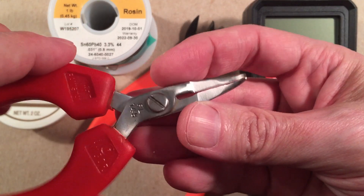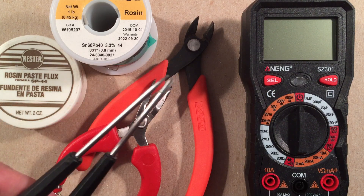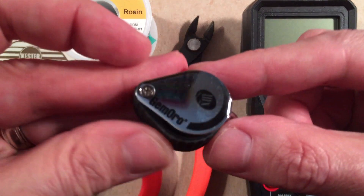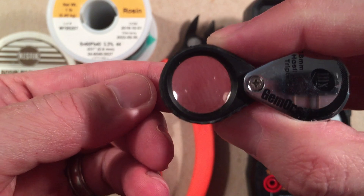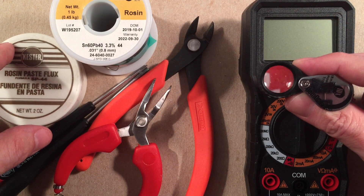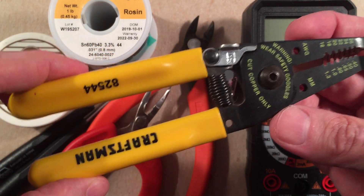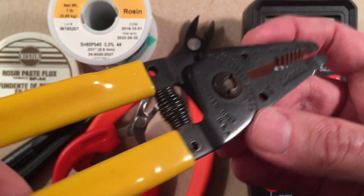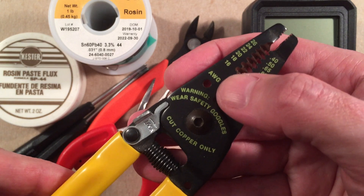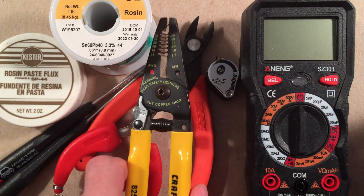And then we have a pair of diagonal pliers — nice for gripping in little areas. We need some precision screwdriver Phillips, those are handy to have. I like to use a magnifier — a 10-power loupe — for inspecting close up on things to see what's going on. We got that, and then some wire strippers — Craftsman, still made in the U.S.A. These work really good for stripping wires, especially smaller gauge, 16 to 26. You've got little plier grips in the front. So you can see all the tools I like to have.